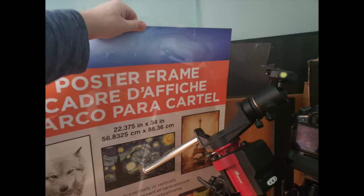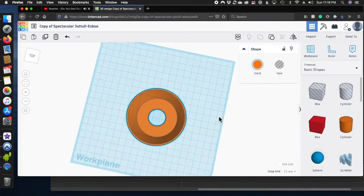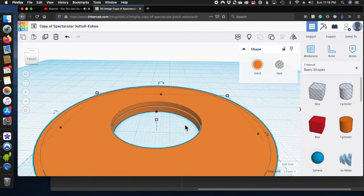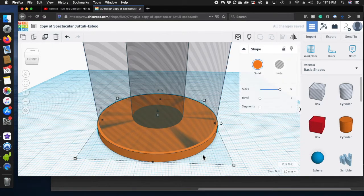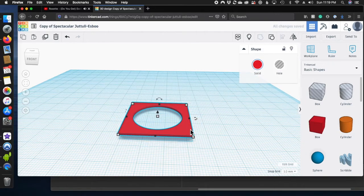In order to create the lens for the sleeve, I purchased a $12 poster frame from Walmart that had a clear plastic sheet over it. I cut out the pieces to fit — in my case, 31 by 31 millimeters. I'm sure there's a cheaper solution, but this is really just a first cut to see if it would work. The 3D model itself is very simple. I used a free online 3D modeling tool called Tinkercad to build it — it's just a simple cylinder with a square 32 by 32 by 1 millimeter gap in order to have a place to hold the clear plastic.